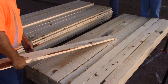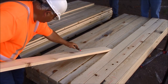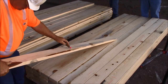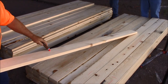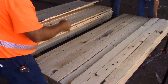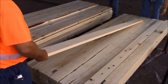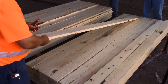Here we have a stain that takes us out of the sash, although we can get one piece of sash there. The sash down the middle here, and then the sash down this edge — it will cut out to 3 shop, it's real close. Here we've got a nice cutting here, all the way down to that knot — that's a piece of 2 shop.